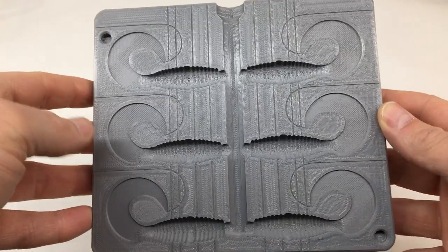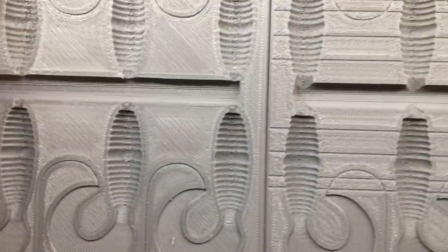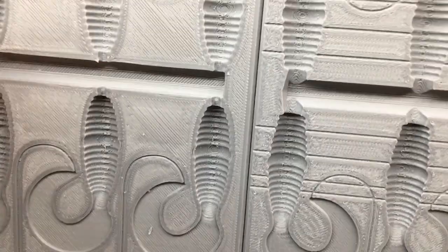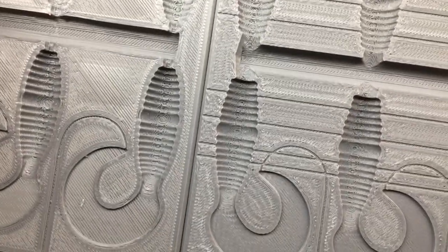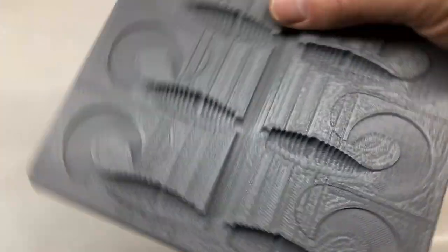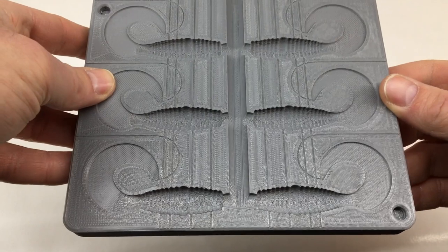Alright, I got version 2 all printed up. You can see all the venting lines now, and the gate's a lot bigger. And here it is compared to version 1. You can see that gate's at least 3 times bigger, and the front of the bait's a lot wider now. So that should actually fit the jig head better. So, I'm going to shoot this off camera just to speed things up a bit, and we'll see if any of these changes had an effect.